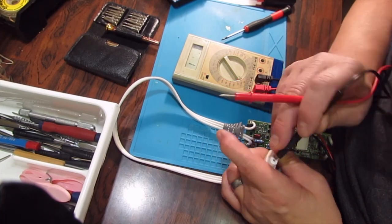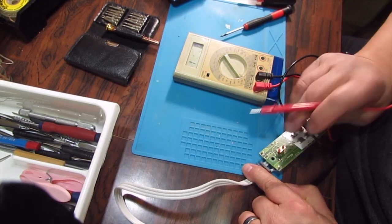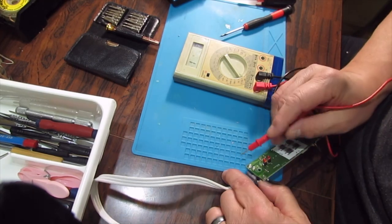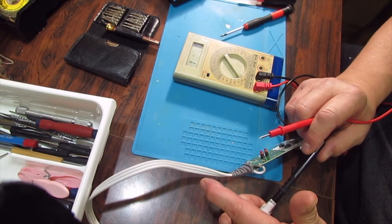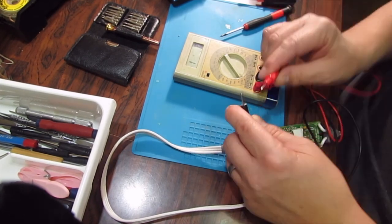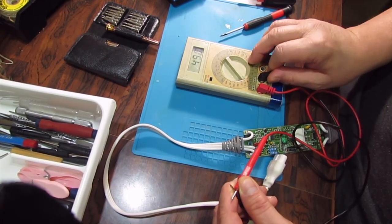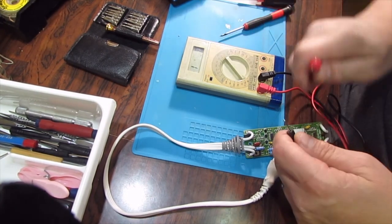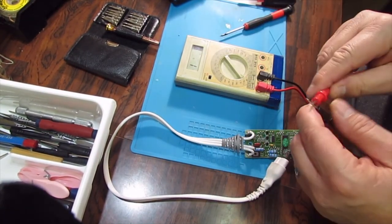Is there even a connector in there? There is. Could be that wire is busted. 40 ohms there, and that one's also 40 ohms there. Why 40 ohms? Because my meter leads have 40 ohms on them — that's why. Why the hell is that? I've never seen that before in my life. Bad contact, I think that's what it is. Well, the meter is 40 years old.